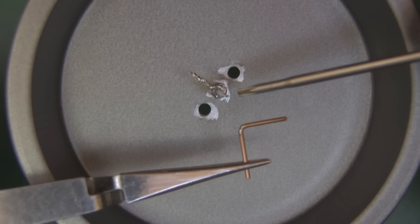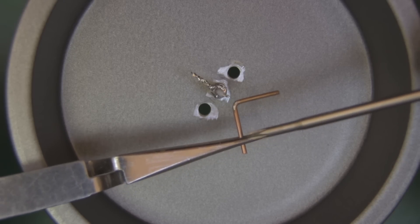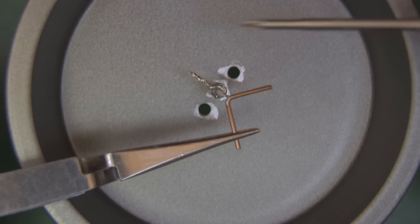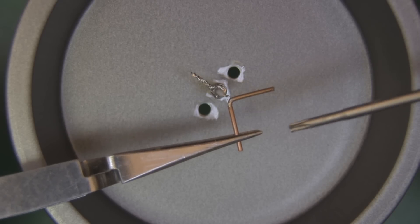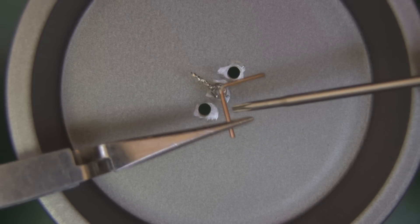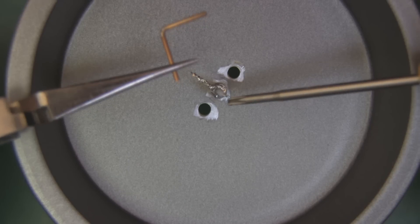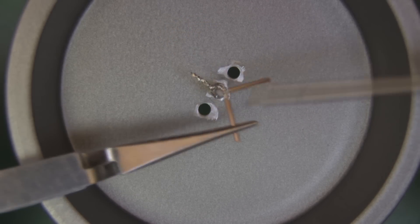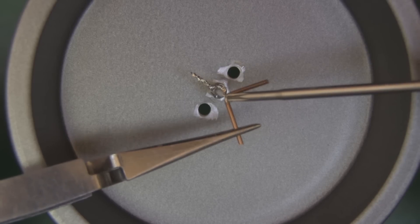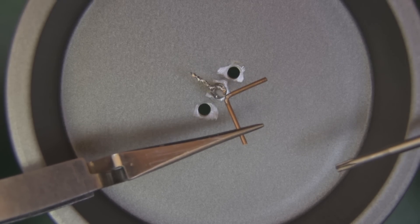Lead off with the signal wire first, just like in the 2.4GHz version, and lead off with the longest leg first. Going long-short-long-short gives you a left-hand circular polarized antenna, which is what I'm making. If you want right-hand circular polarized, just do the opposite and lead off with the shortest leg first, going short-long-short-long. I've already pre-tinned the element at the centre of the bend, and I'll solder it into position with a little heat and solder.